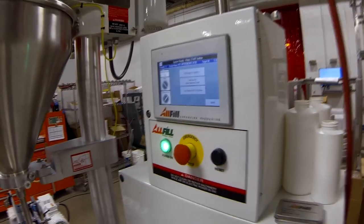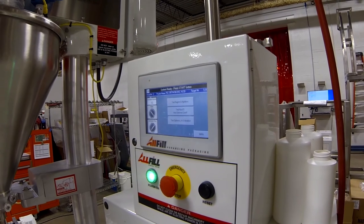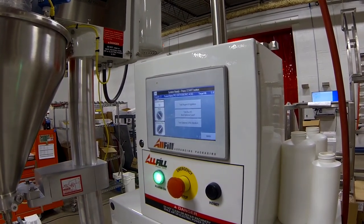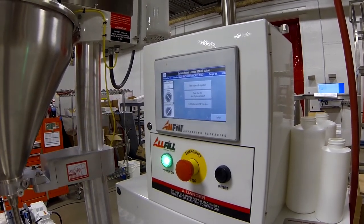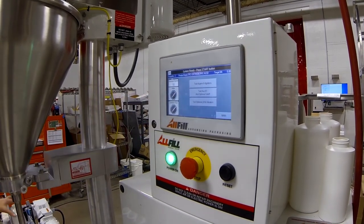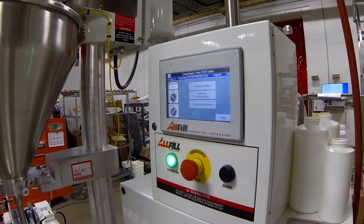That's a big part of your setup right there. Getting back into the controls — that's your initial bottle setup. If you needed to make some tweaks, loosen your lever, shift the pin a little bit to make sure things are as precise as you can get. What you're looking for when those indexing pins shift is that bottles aren't jumping and knocking. Everything seems pretty smooth — everything's shifted the way it's supposed to, everything moved into position. You're checking guide rail tension, everything.